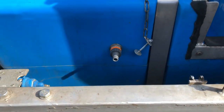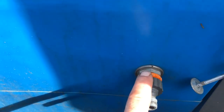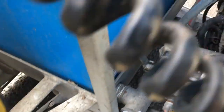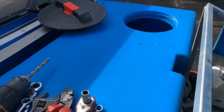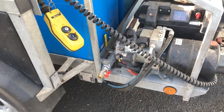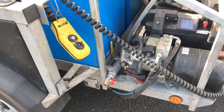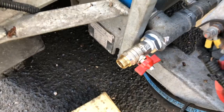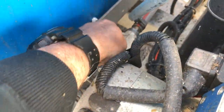The other thing we've put in place — you'll see the water inlet to the tank here where you fill it up normally with the fresh water. We've put this little compartment on here. So what we can simply do is close that valve, leave that shut, open this up. You can then flush that tank out from this side, get the dirt out of this area every so often. You will have to park on a slight slope but it will help protect the actual pump and everything else on the system. So you've got a drain-off point there. We then obviously open the ball valve back up, fill the water tank back up, and the water starts flowing through the system.